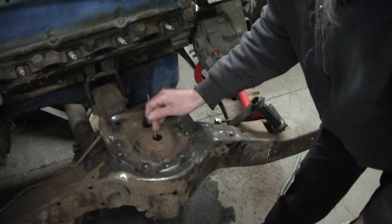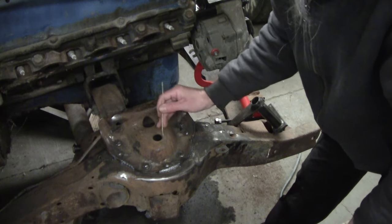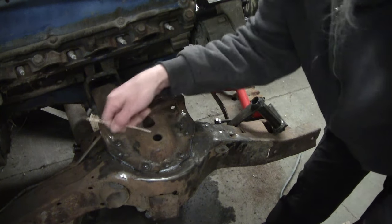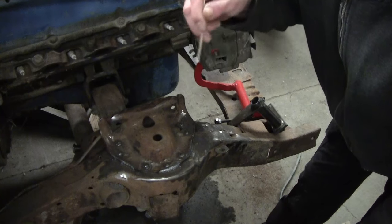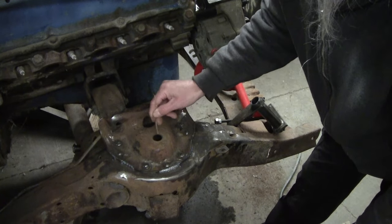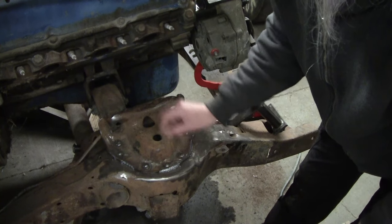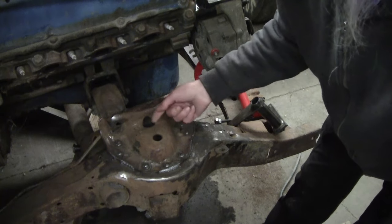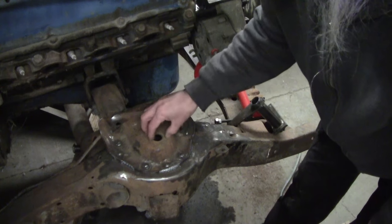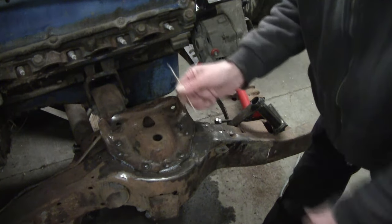Then you work it in a circle pattern like this out to the edge of the hole, to this material. Then you roll it over the outside of the hole like this. And you see the way I'm moving my hand? It's kind of exaggerated because that's a pretty good size hole, but that's what you're doing. You're rolling that wire around in a circle like that, all the way back up to the center, and then you come back into the center and you do a hard hit there, right in the center. When you do that hard hit in the center, it'll lay that puddle and all your filler down like a mushroom over the top of it. Basically, you're making another rivet, but you've also burned in around the edge of the hole, super attaching this to the frame of the car. That's a plug weld.